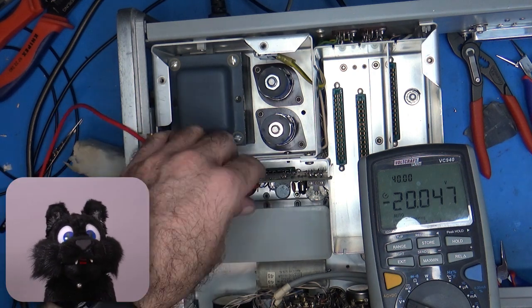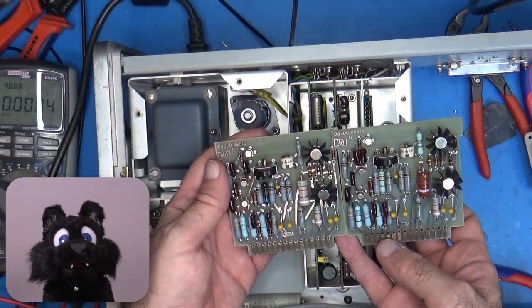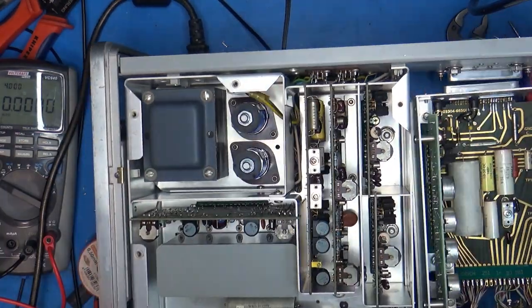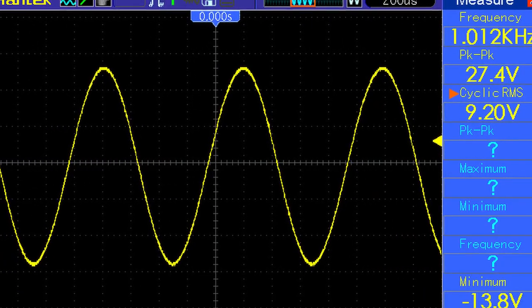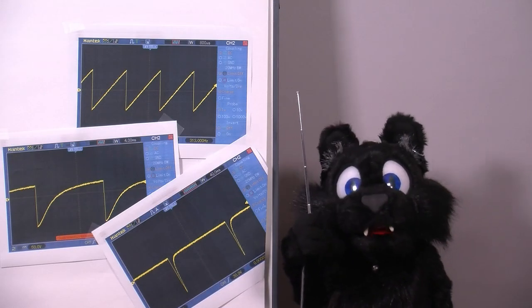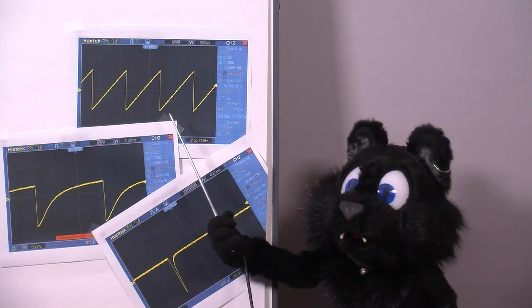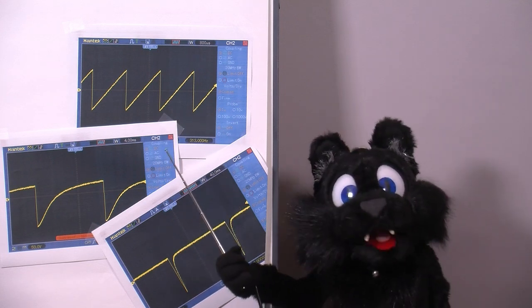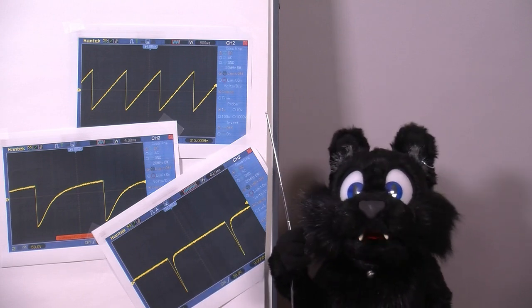Following the calibration guide, I set out to align all the components and to make sure that the dial reads as closely to the output frequency as possible. Woohoo! Signal! I was almost done when I tried to adjust the plug-in frequencies. And for some reason, the generator in there worked perfectly fine in the upper frequency ranges, but the lower ones didn't look like sawtooth waves at all. Something seemed to be broken with the caps that drive these ranges.